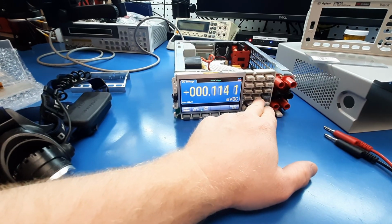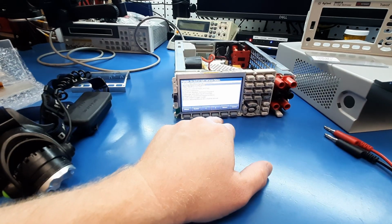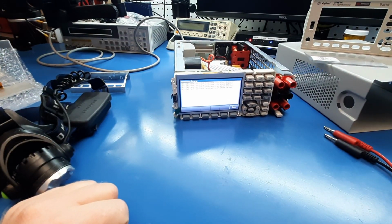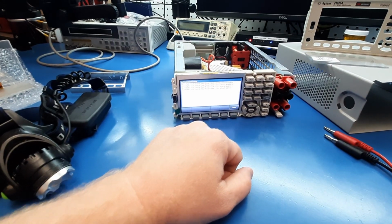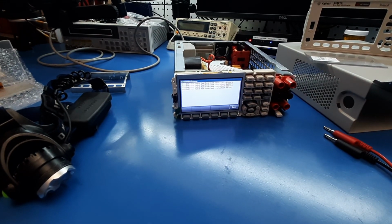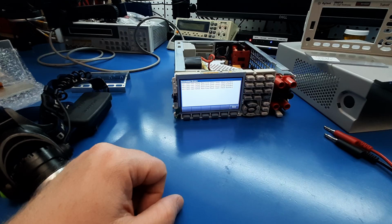Let's go to help, I guess. Oh, okay. Geez. View instrument errors. Oh! Real-time clock reset. Yeah. Check battery. So we're good. I don't know if you can read that. Yeah. All the errors are 611, self-test failed, real-time clock reset, check battery. And it never had the internal battery connected, so we just need to set the clock and...